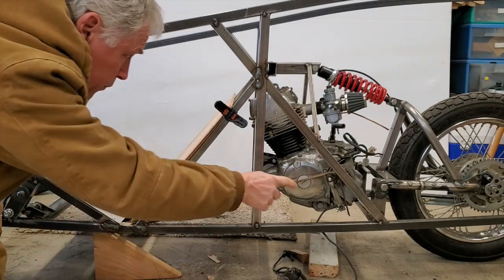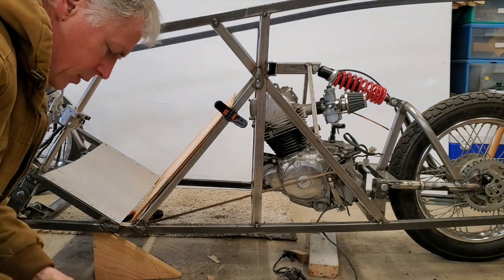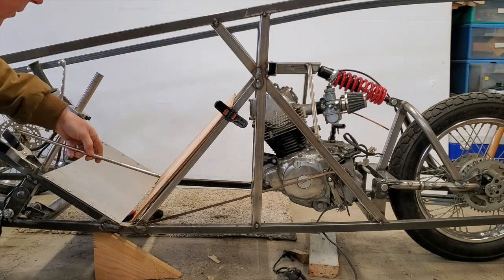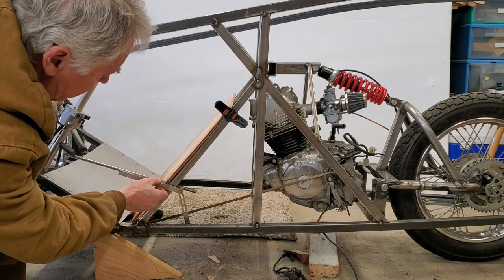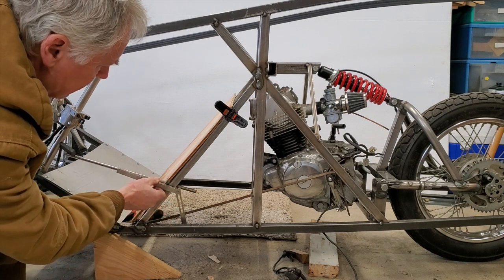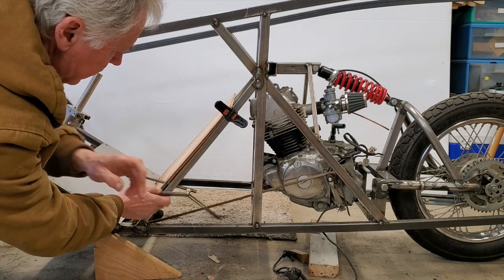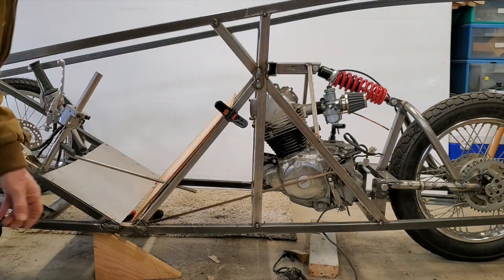Here I'm trying to get the connecting rod, the shifting handle, and the shifting handle at the right angles. I'm just using a three-eighths inch rod. I've used my little angle finder here, lining up the shaft. And now this will be bent 90 degrees to this connecting rod. So I got my angle — let's go bend it.